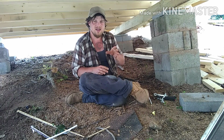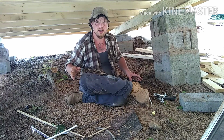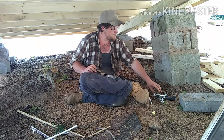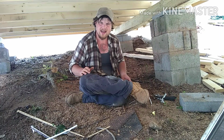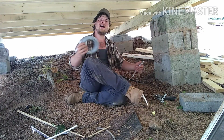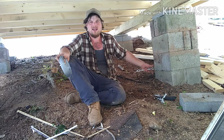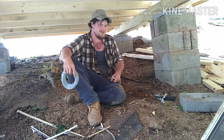The other things you're going to need for this particular system, you don't have to use this system. This is what I'm using. You got your big anchors, the twist end kind. A lot of people think, oh, you got to have mobile home anchors. Not if it's a tiny house. So anyway, it is a shed, man. I mean, this may be a tall shed, but we're putting 6 anchors in it. You only need 4. And technically, you probably only need 2 at the tall end.